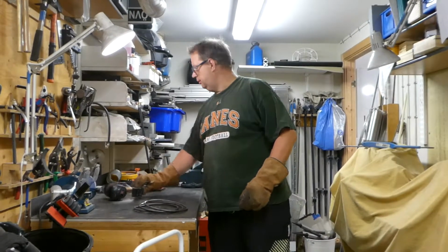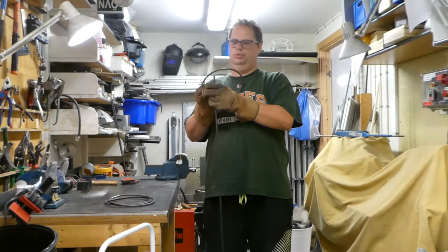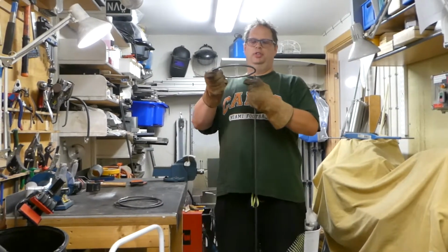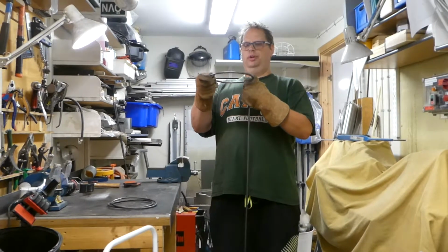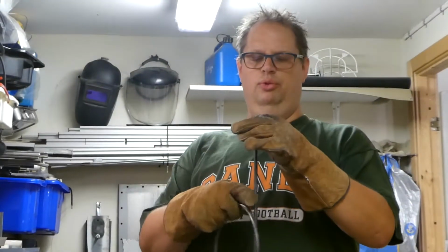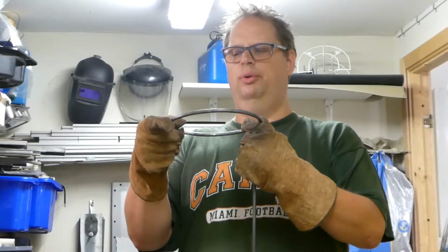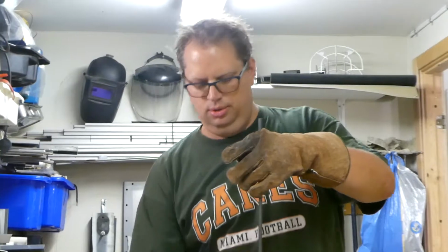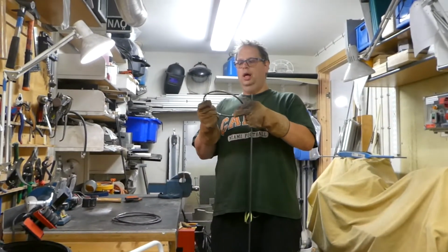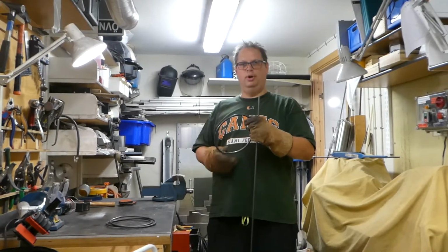So the next step. This one should go 40 centimeters or 400 millimeters down into the ground. I decided to put those at the inside and the ring at the outside. The tricky part here is to weld this on at 90-degree intervals. Otherwise you will rather quickly see with the eye that it's not done correctly. But my idea is to first weld one, two, three in place and make sure that they are 90 degrees to this one, and then add the other three.